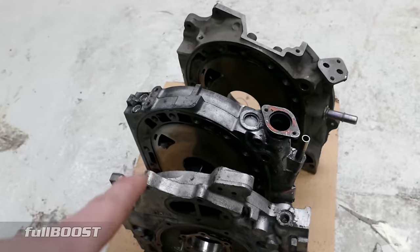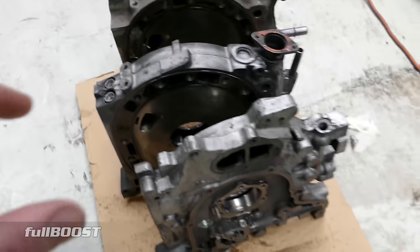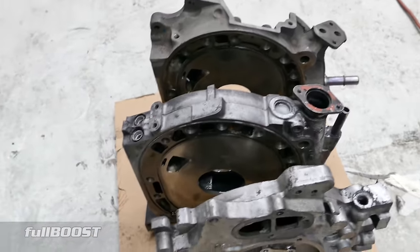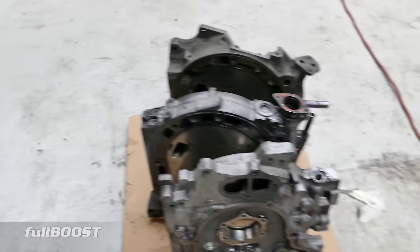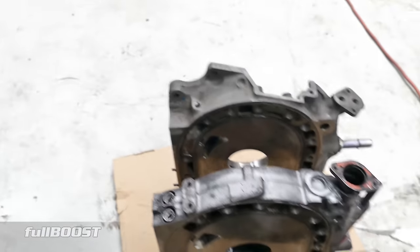The housings are obviously aluminium. These are steel, and there are machine liners and stuff here too. The faces of these irons — once you use a chemical to clean them off, you can almost see a little bit of surface rust starting straight away. So always spray the face surface of the plates with some form of anti-corrosion inhibitor. Even when they're dry, it doesn't mean they won't rust if they're completely naked and bare surfaces. I always spray all the oiling, bearing, and oil passage surfaces so there's no rust getting in there either.